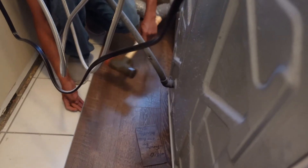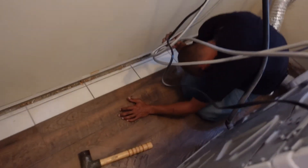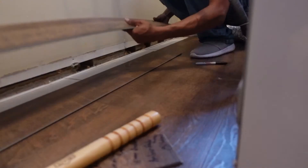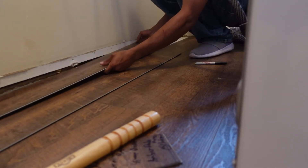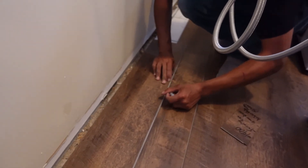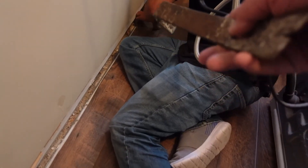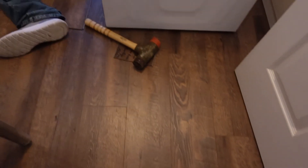See, the idea is if you lift that up too high, you'll pull this board out — the last board. So you've got to lift it up, but not too much. That's why I usually try to kneel or keep my foot on this board, so you don't flip the whole row up. So this is my last row trick here. Basically, we line them up above that row and then we'll use a board. As long as you're pretty close — if you're like a blade off or two, it doesn't matter. Just get it in the neighborhood above the last row, and now you've got them all lined up. Put that board up against the wall — where it meets, that's where you draw your line. Draw your line where they intersect, and that's where we cut the board. Lean it up, and then use the pry bar in the wall to help you get it to close all the way. I heard the click — you're good. That's all there is to it. Under the sink, under the washer, under the dryer. No threshold. Waterproof vinyl flooring at its best.